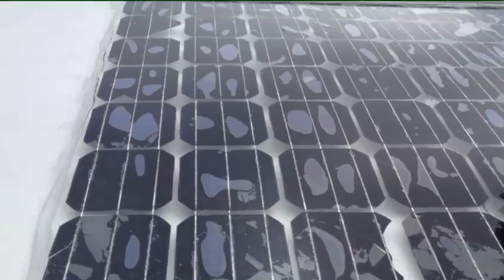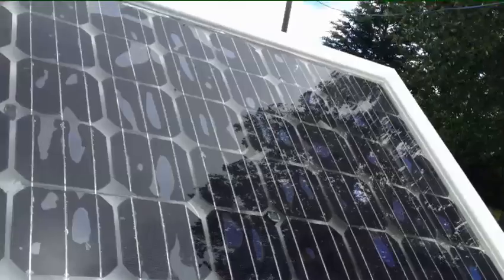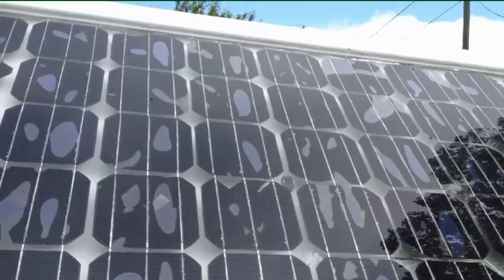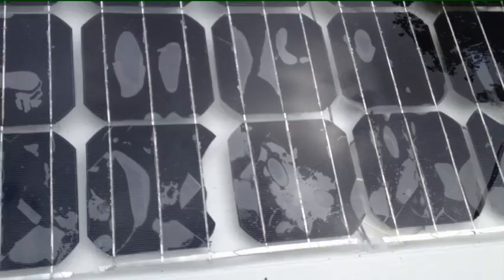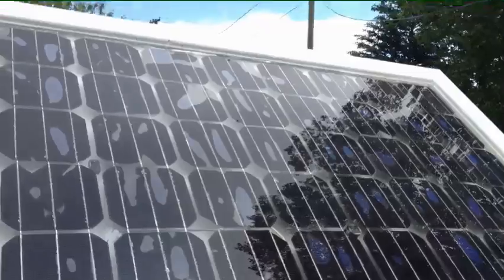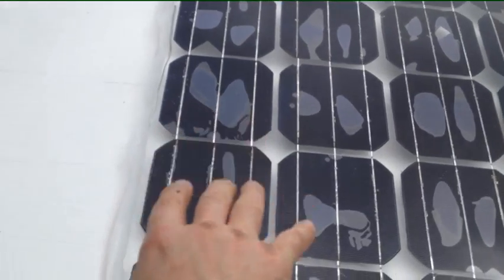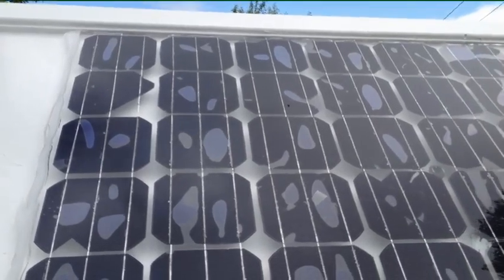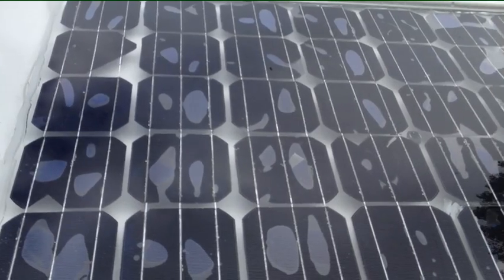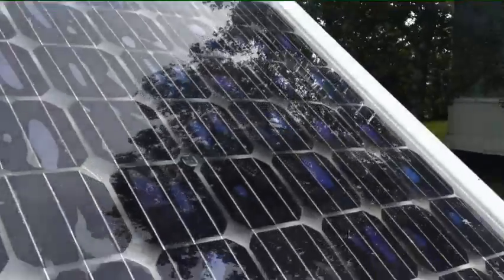You can see some cells that broke in the process. I had difficulties keeping the soldering from sticking to the glass, and in the future I'll build a template to do them one row at a time. They're very fragile and I was reluctant to solder a full row and then handle it. It was a learning experience. You can get 240-watt Kyocera triple busbar solar panels for around $570 at the altE website, which I'll put in the description.